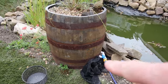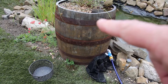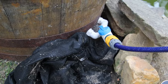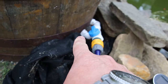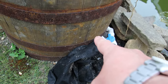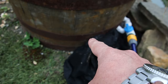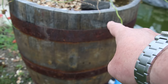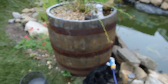To explain the barrel filter — it's got different gradients of gravel from larger to smaller going through there. The water goes in here, so you can see we've got two inlets. One on the left is the feed from the pump which sits in there. That comes in here, and what it actually does is a pipe goes all the way up to the top, a tee piece, angle, and all the way back down to the bottom. That means the water starts at the bottom, goes all the way up. But should I turn the power off, it doesn't immediately drain back into the pond. And that works fine.